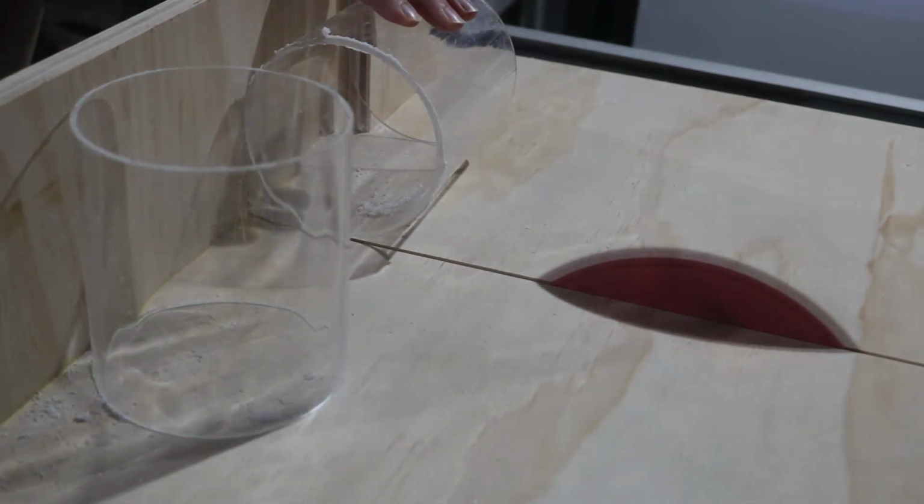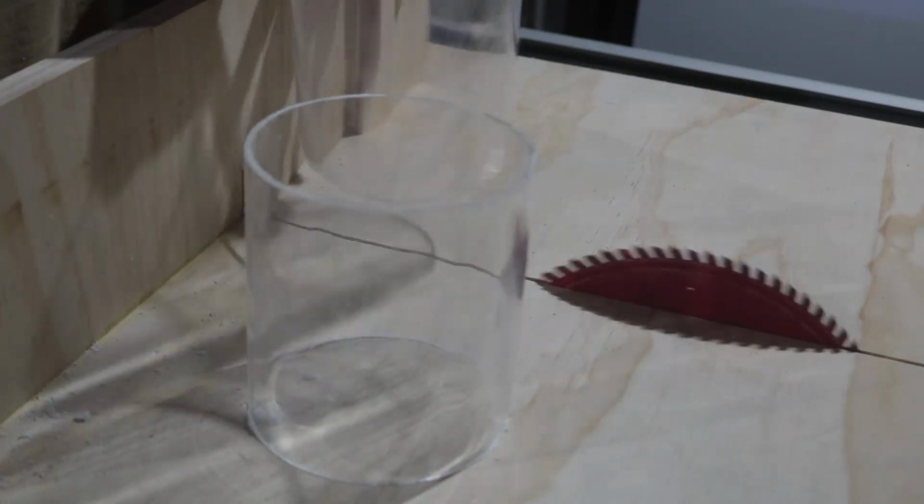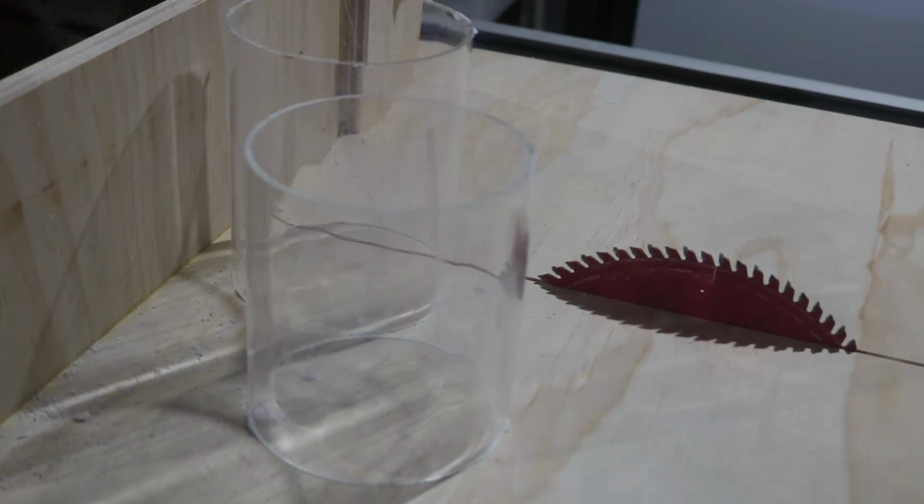And one of the reasons why I can go to this size is everyone's decided they want the water to come from the top, or most people anyway. And that gives me the added amount of force that's acting on the drum. As the water comes out of whatever spray bar we decide on, it's going to, with gravity, add an extra amount of force that wouldn't exist if this thing were sitting in the water and water was going by it underneath. And also, there won't be the friction of the water slowing it down as well. So I can go bigger, and bigger means heavier and all that sort of stuff.